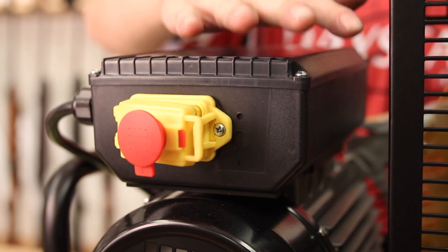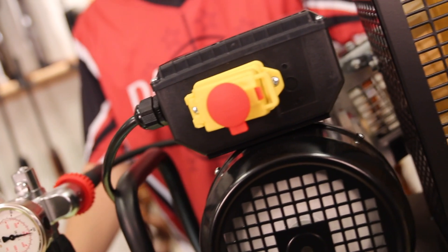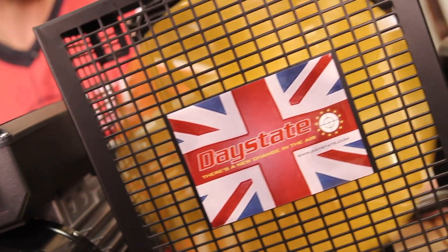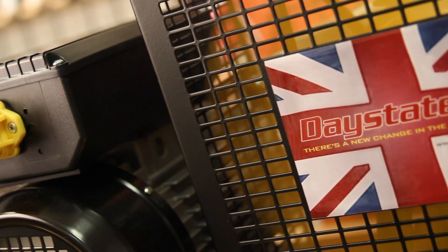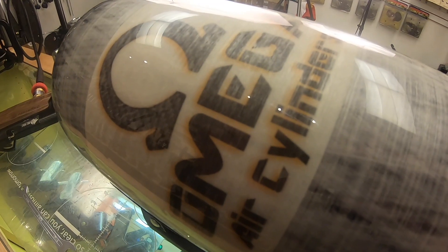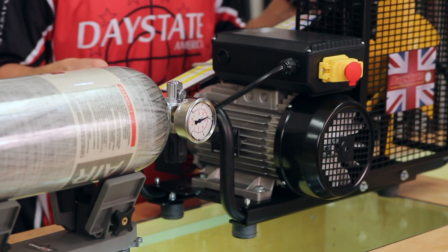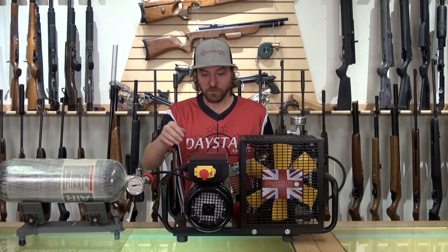Your electrical box sits on top of the motor. This is a belt-driven unit — when you turn the motor on, it spins the fan, which pushes air over the unit to keep it cool while it runs. When you're running for as long as it takes to fill a scuba tank, all the airflow and oil coolant you can get is great. I've enlisted the help of an Omega 75 cubic foot tank, connected via the DIN fitting on the valve — it has just under about 3,000 PSI in it. The DIN screws in, the tank pressurizes the line, you make sure your bleeder trap is closed, and we're ready to fire it up.